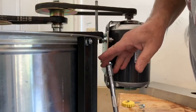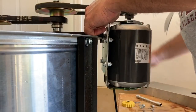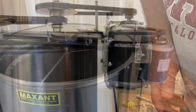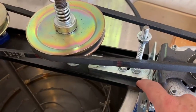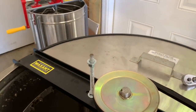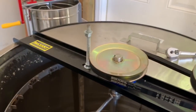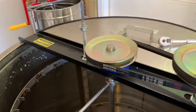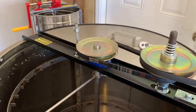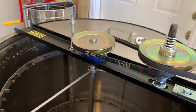That was a little smoother that time. Let's pull these out of here. We got that part done. Now with the bolts out and the other end down there, this thing will lift up, but the whole rack inside moves. So what we've got to do is remove the belt off of there — this belt system — and then it will also disconnect from the rod that goes down into the rack. Once we do that, the motor will come off along with the belt system, and we can easily remove the rack, the legs, and the tank and take it out and spray it down.